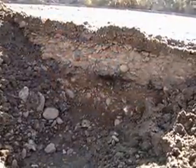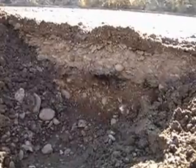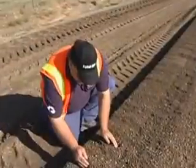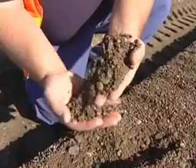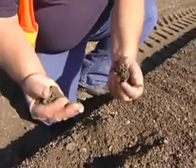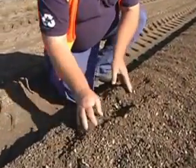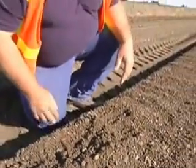If you can see this, we're grinding it to a depth of about twelve inches. You can see the top four or five inches of base rock on top of the road and then the existing sub-grade below that. Look at that material — it's perfect. The gradation is perfect, the moisture is perfect, the fines are perfect. The asphalt is all crumbled up into little bits and pieces. Look at this half inch piece — that's asphalt. This material is perfect for making a wonderful base.